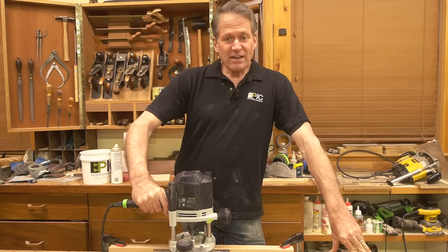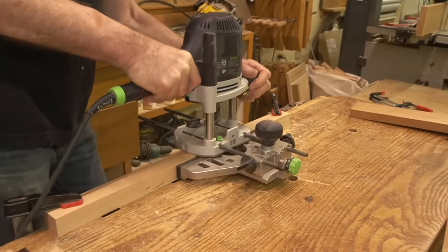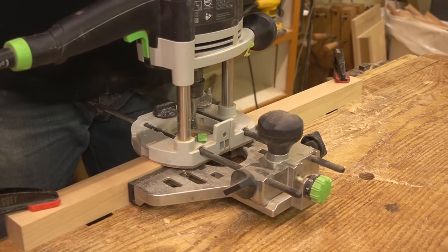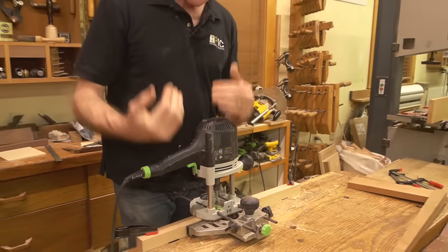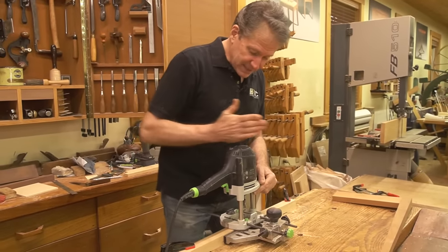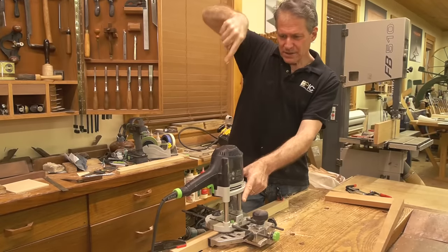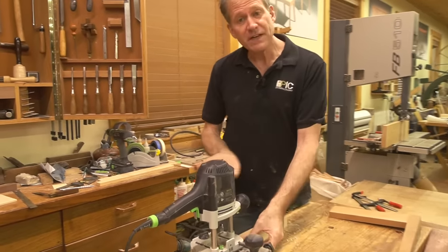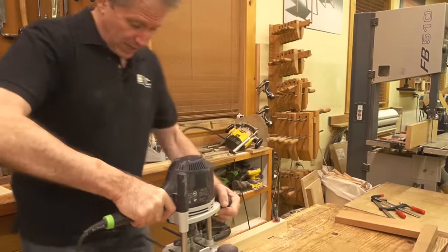So when I'm on here I'm a little bit shaky — I'm shaky plus the piece is shaky. It's not good. Now, when you plunge your router, looking down from the top, the router bit is always spinning clockwise. When it's spinning clockwise like that, it will pull the fence toward the work piece if you move from right to left looking down. The lead of the cut is going toward the fence. So as I'm pulling, I want to take advantage of that — I want that fence to stay tight to the work piece. So I could simply plunge in that direction and make a plunge cut like this.